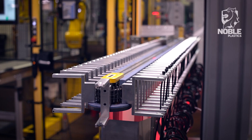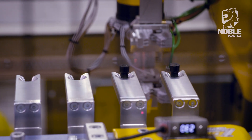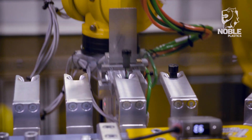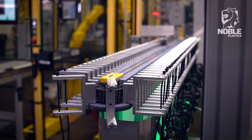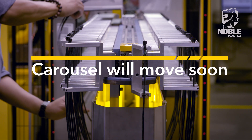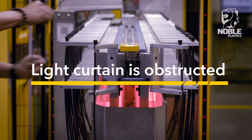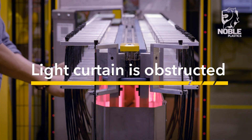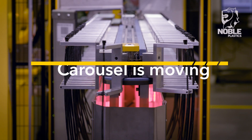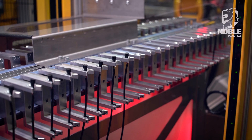The process begins with the operator loading an accumulation carousel with substrates. The procession of the carousel is controlled by robot one, provides the robot with five substrate pick positions between carousel moves, and provides the operator with visual cues as to the status. The green light signals it is safe to interact with the carousel and place parts. The yellow signals that the substrate supply to the robot is low and the carousel will move soon. Blinking red signals that the light curtain surrounding the carousel is obstructed and parts are unable to travel to the robot, putting the cycle time at risk. Solid red signals that the carousel is moving and should not be interrupted. The system accommodates gaps in the loading.